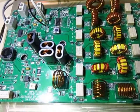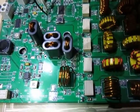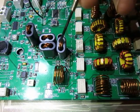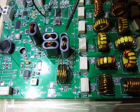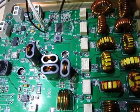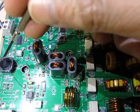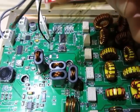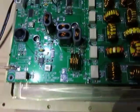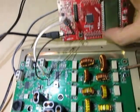Quickly round the rest of the board: there are some nice relays there to select everything, and it's got all the low pass filters as I've just said. This is the output transformer with these three ferrites — it's a slightly novel output transformer. The third core is a bit of a trick to improve the effectiveness of the transformer. There are the little bar graphs, and that's the input transformer over there — it's a ready-made, ready-wound balun off the shelf, no winding required. It's set up with the KX3 which activates through the PTT line, which is a short circuit on transmit. The power supply comes off there, and I've been programming it with this little board which acts as a programmer — this is a Texas MSP micro.